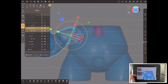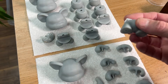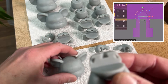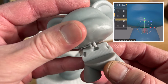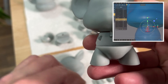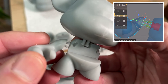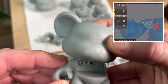Let's have a look at the output print and I'll show you how it all snaps together. I've got loads of printed parts now and I'm just trying all of the fitments. This is the body that shows what it's like internally. You can see the recess and how the peg fits in and snaps into place. It goes inside like that, pinches together at the top, and then opens up once it's in. So it goes in there, down into the countersink, pinches together, and then fits into that socket — and then it has the rotation there.